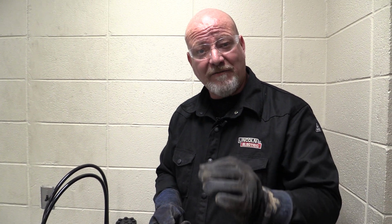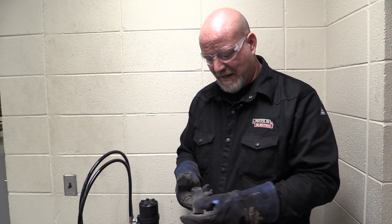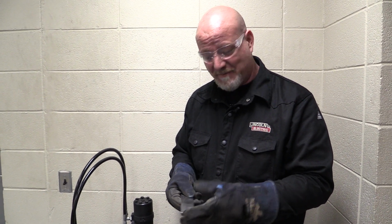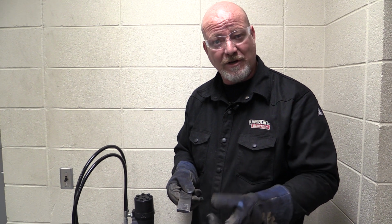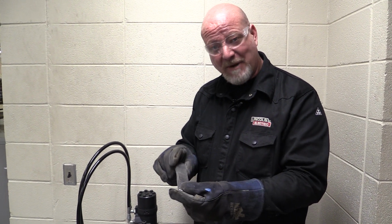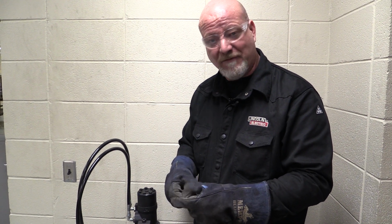But for now, let me just say this. When I tacked these pieces up and when I welded them, we were doing it for video purposes. I did go over and quench these in the quench tank. Let me be clear, you never, ever, ever quench anything you want to test. So what I'm saying is, I don't know if these are going to bend or not, and that's fine for these purposes, because if they do break, then I can show you what that looks like too. So these are 6-inch pieces. I'm going to bend the face bend first.